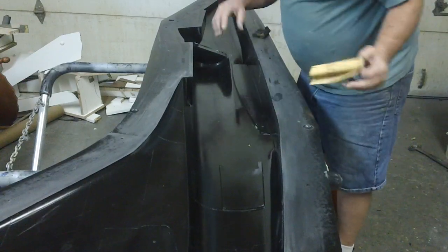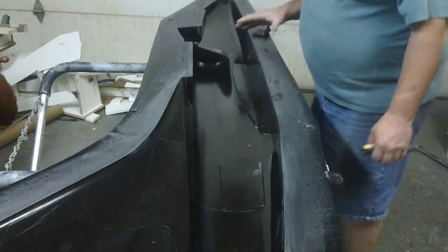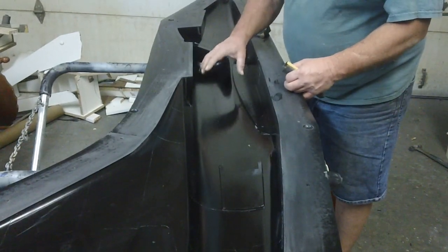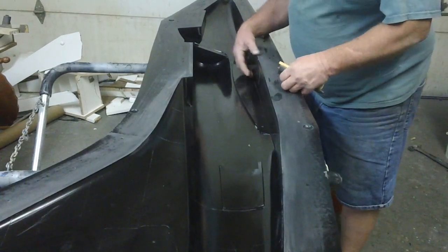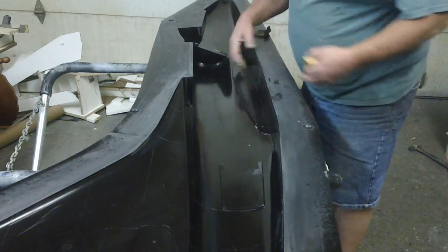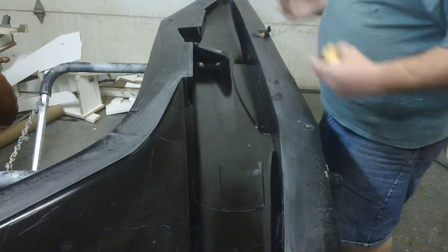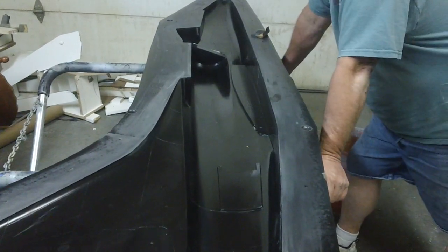But I want that tank right here. I want my fuel tank right on the CG. I don't want to have to put it forward. If it was a one-piece wing, this fuselage would be a lot smaller. You just get a turbine in there. Now, with the plug-in wings, I can add a big old fuel tank. I can put a gallon of fuel, I think, right here. And it won't be out on the nose, causing a nose-heavy situation. I want this plane to fly good.